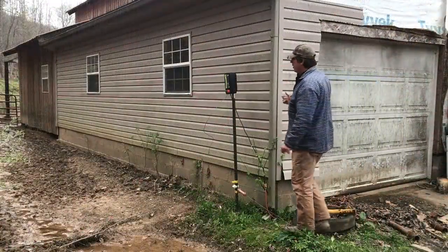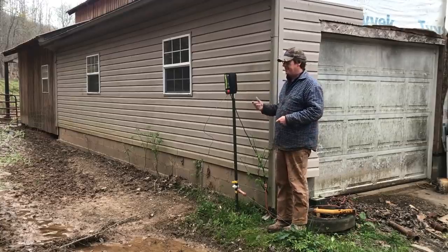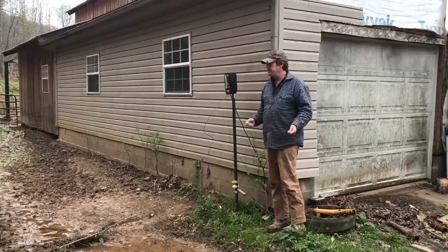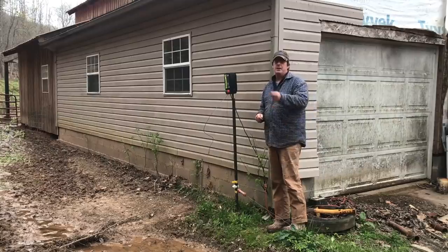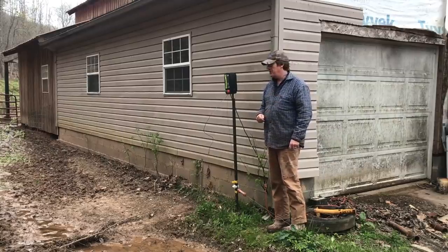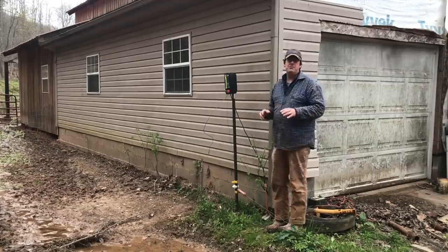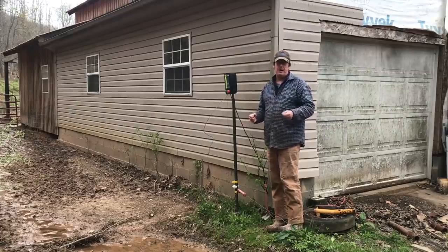Now there's two ways I can go about walking the line, and the first would be to take my tester and maybe something insulated, usually an old broken step-in fiberglass post, and just walk the line with the charger hot. If I see anything laying on it, I can flip it off with that insulated piece, and test as I go along. Sometimes the obstruction's too great and I need to actually move some things, touch the wire, all that.